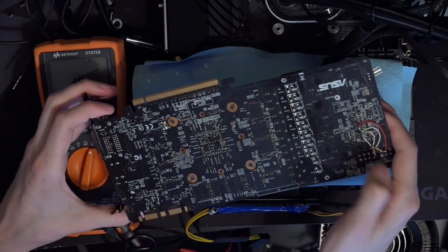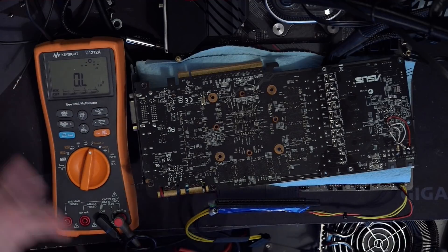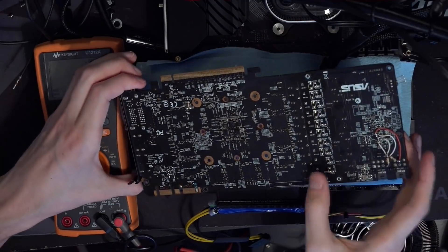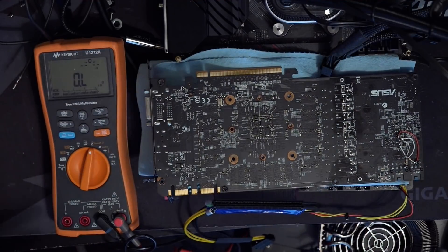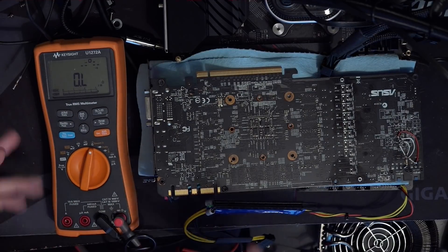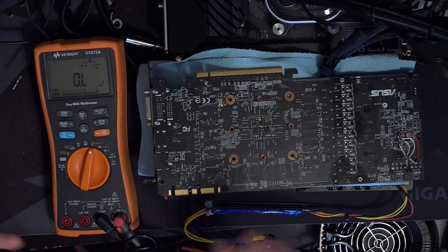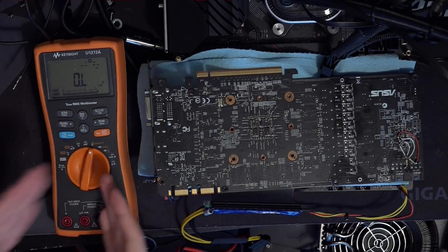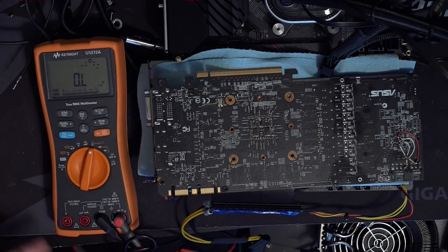I had a power limit removal mod on this card, but that's useless now — the card just died again before I could get further with modifications. I'm probably going to steal this VRM and stick it onto a GTX 1080. This is just a new procedure I've been messing with for building power boards out of cards. In the past I would cut the VRM first and then worry about why it's not turning on later. With this procedure, I have the VRM running, and I can step-by-step move all the necessary components over to the side of the PCB I'm actually going to use, then cut it off without any mystery troubleshooting.